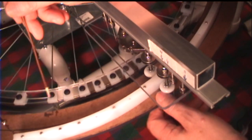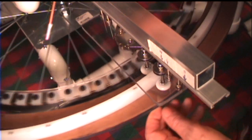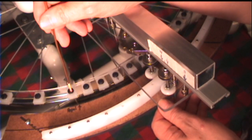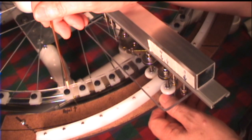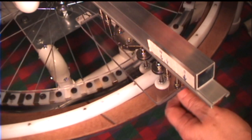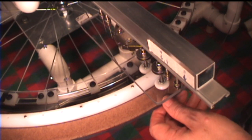It would be easier to move the stator carriage after you pass the last magnet of the south group. But ideally, it would be best if you could have the south of the stator magnet positioned right at maximum repulsion, right at the tail end of the south group. While it would be best to do that, it probably isn't possible.